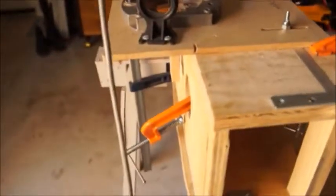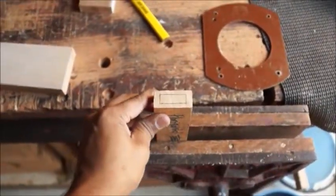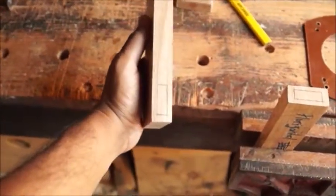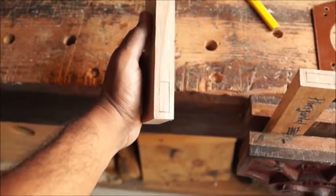What I'm going to show you is an example of how I actually use this jig in operation. The first thing I like to do is actually mark out the mortise. You can see I've marked out the exact mortise — in this case on the piece where the end-grain mortise is going to be made. Over here I've also made the matching mortise on the face-grain side. I find this useful because it allows us to set up the jig once and keep the same measurements for all our mortises. Remember what we're aiming for is something that looks like this, with a matching mortise in another piece which then simply clicks into place.